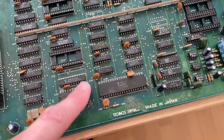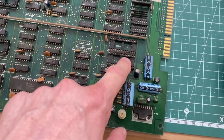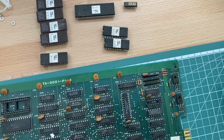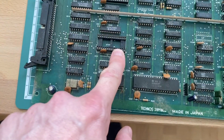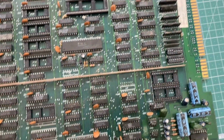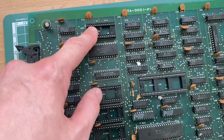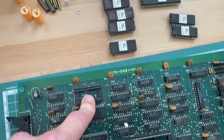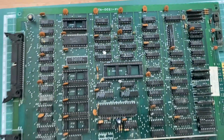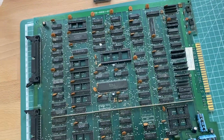And we have another CPU over here for the sound. This has 2 EEPROMs here which contain digital sounds. And this EEPROM here contains the program code for the sound CPU. And this EEPROM here actually contains some graphical data. I think you know, the text layer, so the display layer of the game, the characters of text and so on are located on this EEPROM.